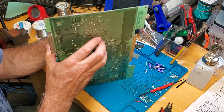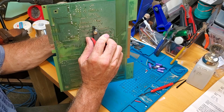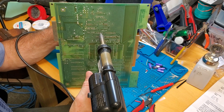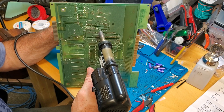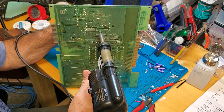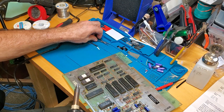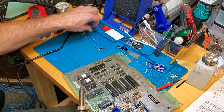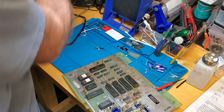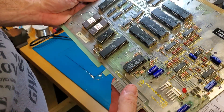I'm going to make sure this solder is fully heated up before I hit the sucker, then I'll pull it out and hopefully it'll come out nice and clean. If the lead is sticking out and not straight you can straighten it before you begin. I'm pulling lightly while applying heat — I can feel it — there we go and it's out. I was just lightly pulling while applying heat; once it started to move I hit the sucker and sucked all the solder out.